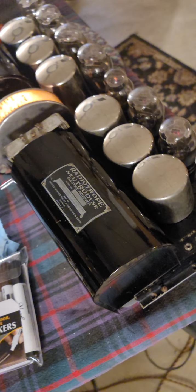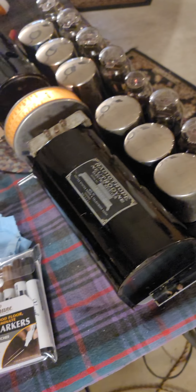All right, an update on the Apex Model 80. I am now at 114 or 114.6 volts of AC. I am pleased that my indicator lamp is working like I thought. All of the filaments in these tubes came with the radio, so they're all suspect, right? But yeah, that's my multimeter saying time to check in.